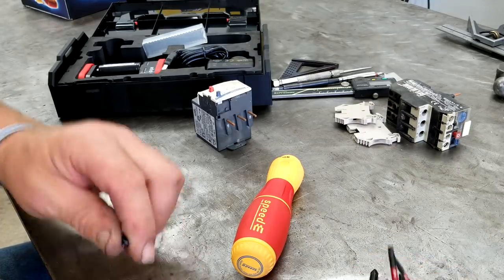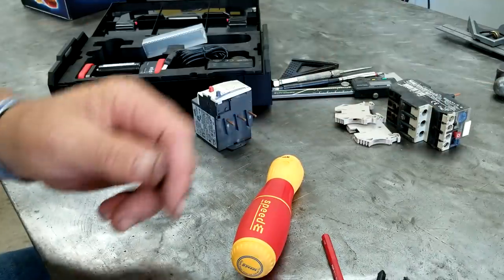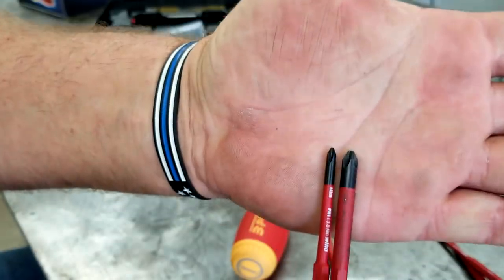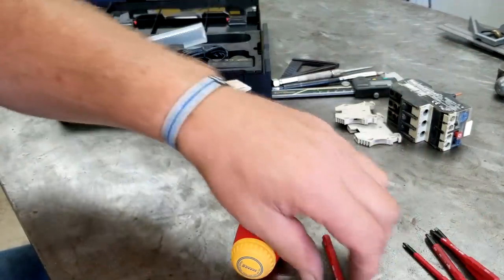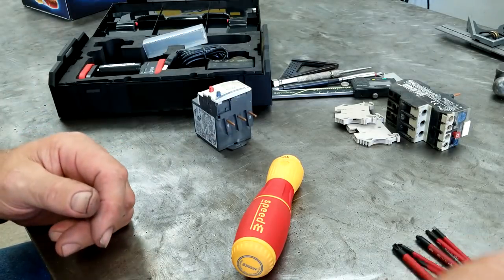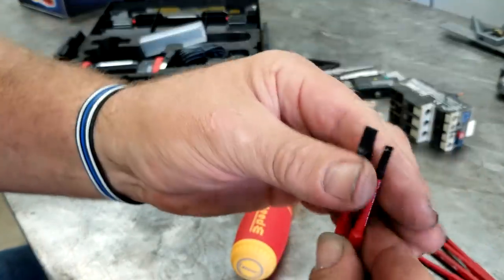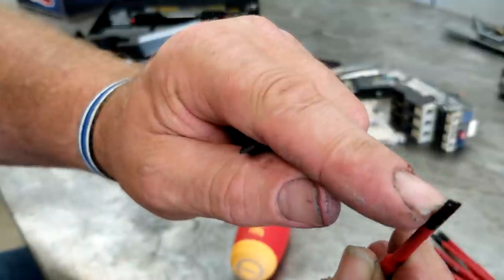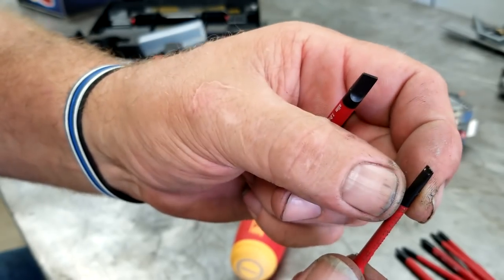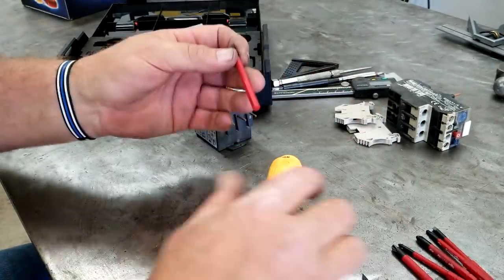These tips are pretty cool. I've got a couple of Robertson drives here — two sizes of Robertson square drive. I have a number two and a number one plain Phillips. I have the combo driver — Phillips and flat, looks like a number two and a number one. I have two different sizes of flat blades. This one we call a T&B driver — Thomas and Betts — for Thomas and Betts terminal strips. On my regular screwdrivers if I see that tip, that's called a T&B driver. And there's a standard panel driver, very slim, fits in here great.